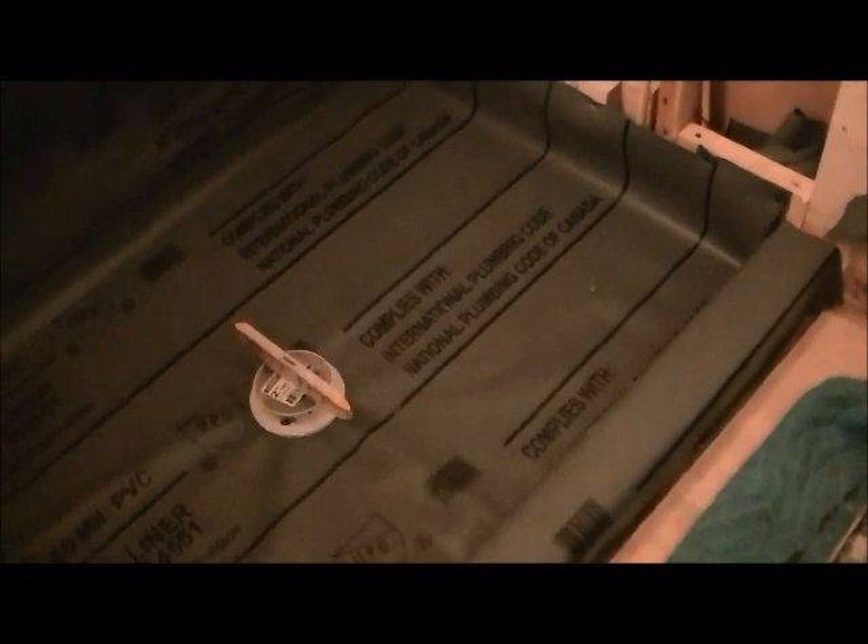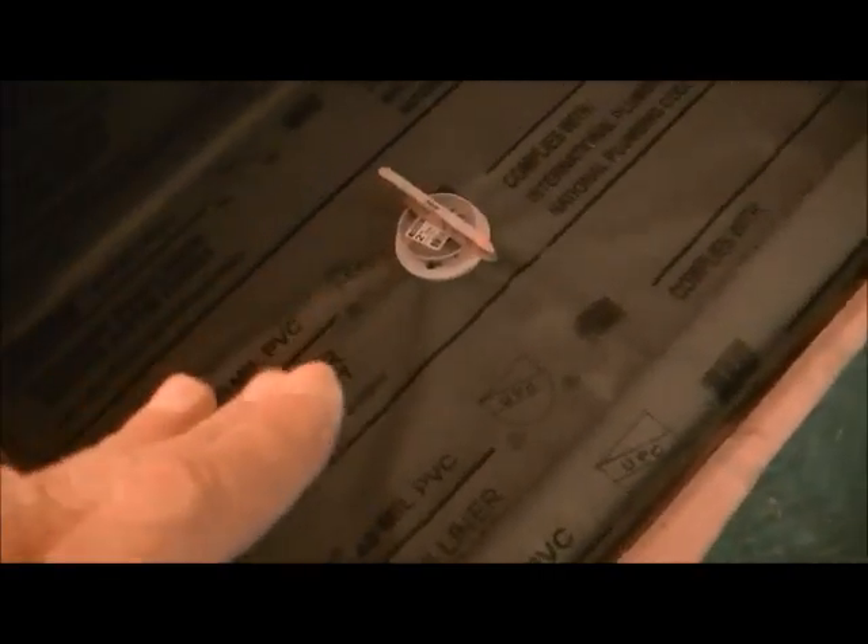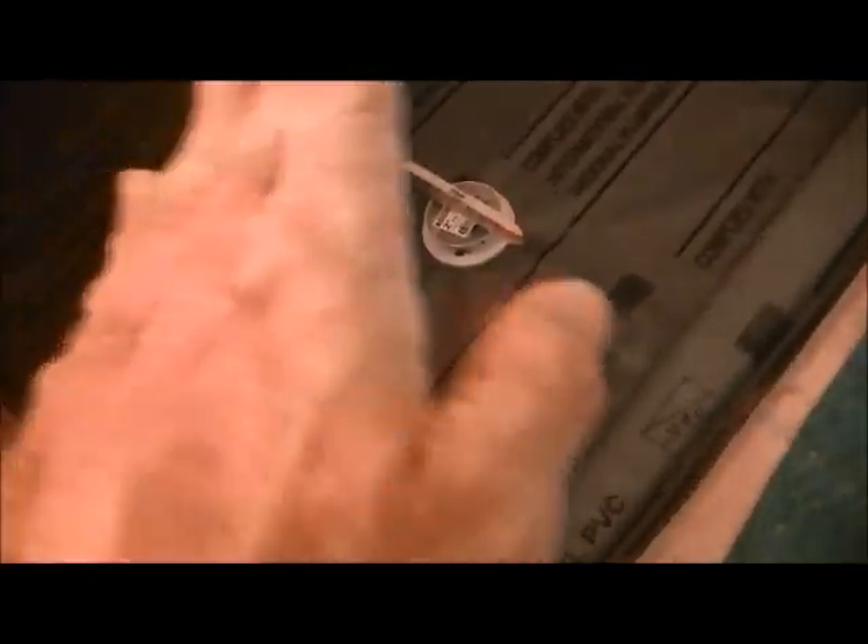The total time to take out a pan and put a new one in is under four hours - it's easy enough for an experienced contractor. But this is not a one-day process. The mortar still has to dry overnight. Then come back: put up wallboard, mud gaps, apply red guard. A second coat of red guard has to cure overnight. Next day set the floor tile - that dries overnight before grouting. Then grout the floor and set the wall tile, which also has to dry before grouting. Regardless, it's a five-day process. Anyone trying to speed it into two or three days - don't do it. It's at least four to five days just to do a pan.